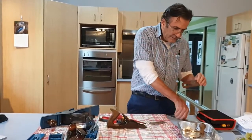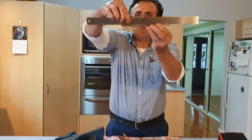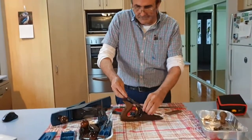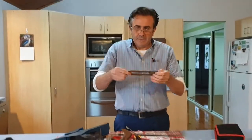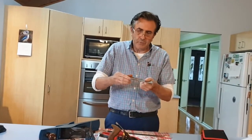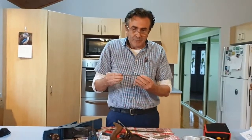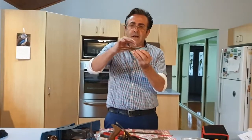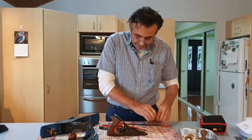When I was taking this off, I noticed that the blade has probably been dropped at some stage. It's quite buckled — there's a major dip in there. That's probably because the plane came off the bench. When we come to straighten this blade, a word of advice: don't put that on your bench and try to hammer it — it's too springy, you won't straighten it. We'll put that in the hydraulic press in the workshop later and we'll straighten it on the press. So don't waste your time hammering at it. There's your blade and there's your chipper.